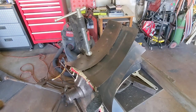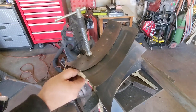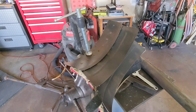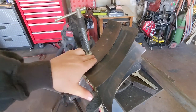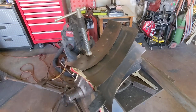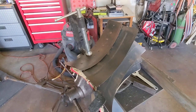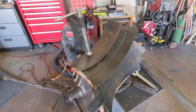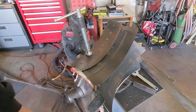That's pretty much it. I'm going to go ahead and pull all these rivets out, then re-stitch and reinforce the lining a little bit, and then put it all back together. But as far as today's video goes, that's it. Again: hammer, chisel, punch sometimes — but if you get that chisel nice and sharp and shave that rivet down nice and flat and it's not too wallowed out, it should just fall right out and you can plop them out by hand, at least with these single plates. Sometimes when you have another piece of metal riveted to metal, you will need that punch, so that's good to have on hand. Thanks for watching — I hope that was useful. Matt Aaron, Armored Academy of Arizona.